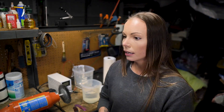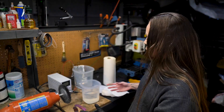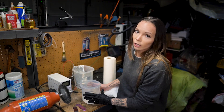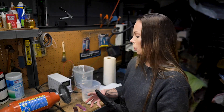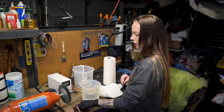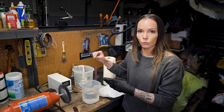If you have a cabinet I'll link some blast media below — we use glass beads, crushed glass, and also aluminum oxide, though I don't think they have our brand on Amazon. There are multiple ways to do it, but the easiest way assuming you don't have access to a bunch of power tools is to use Multi-Etch or Wink Rust and Stain Remover. We're doing cold Multi-Etch so ours is diluted and will be slower — pure Wink undiluted will be much quicker — but personally Richie and I prefer the finish that Multi-Etch leaves. So we're going to take it into the etchant and watch as the colors revert back.